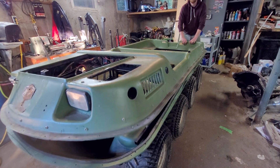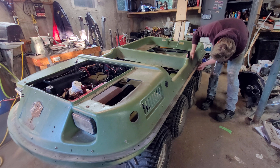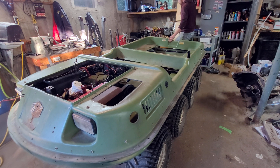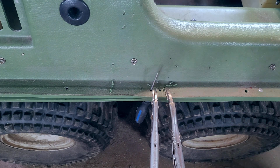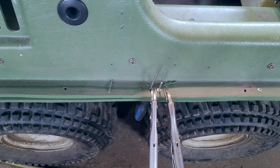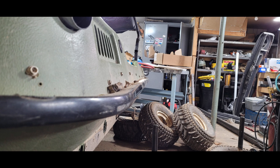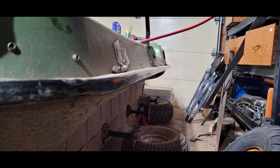At last, we can stick the two halves back together again. I got the existing holes to fit over the new larger supports by using a heat gun to heat them up until I could form them to a tight seal past the plastic. All that's left to do is rivet the body back together and put on the black weather strip. Most of the body holes lined up pretty nicely. Those that refused to line up, I brought in most of the way using a pry tool and then drilled a new hole and inserted the rivet. I've run the machine for about 50 hours since rebuilding the body reinforcement frame, with the machine flirting with the 1,000-pound payload capacity a few times, and so far it's held up perfectly.